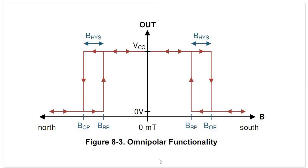Instead of one hysteresis curve, we have two hysteresis curves. Just like a switch before, I'm going to approach the face of the Hall sensor with the south pole of the magnet. The output voltage from the analog section will reach a certain point — B-operate — and the corresponding output pin will go low, turning on an LED or whatever you happen to have connected. As I pull the magnet away, it will go down to the B-release point and turn off.